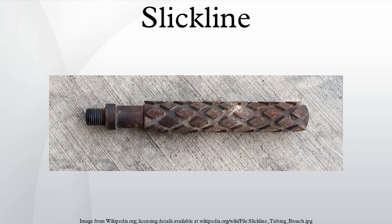If an obstruction is found downhole, a lead impression block can be run to help determine its nature. The lead impression block has a malleable lead base in which the obstruction can leave an impression when they meet. It is called a wireline camera because of its function to mark any object downhole. They are also sometimes called confusion blocks because they only give a two-dimensional view of the downhole object, making it hard for an inexperienced person to determine what three-dimensional object is in the hole.